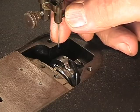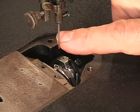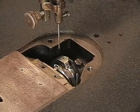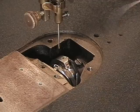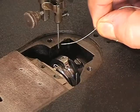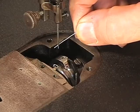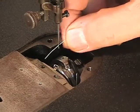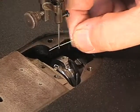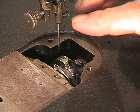That's its class, 88x1. And this is a size 18 opening because I'm using size 69 bonded nylon thread, which is very much like upholstery thread when you buy it at Coats & Clark's. Here's the thread. They need to slip and go back and forth nice and easy. So I just threaded this needle with this thread, and that's how quick and easy it goes on. Alright, here we go.